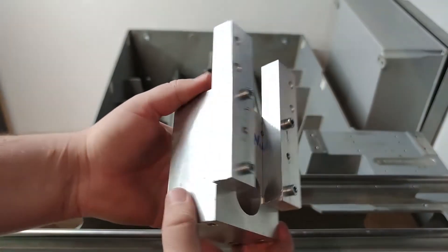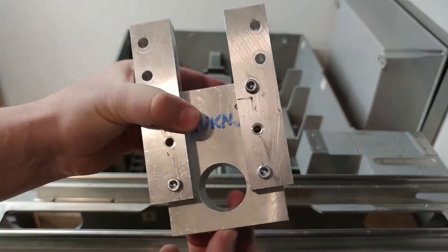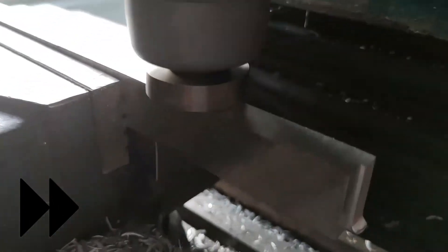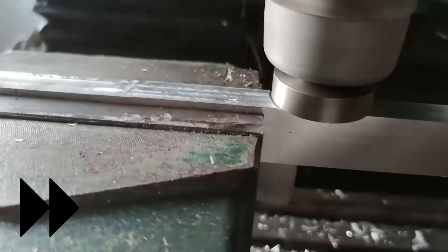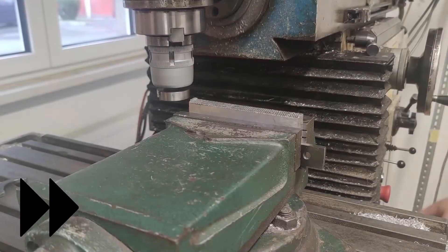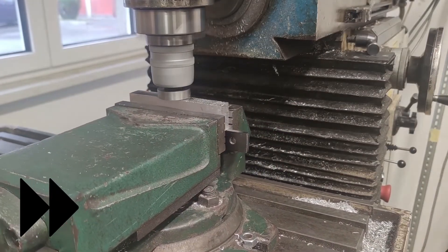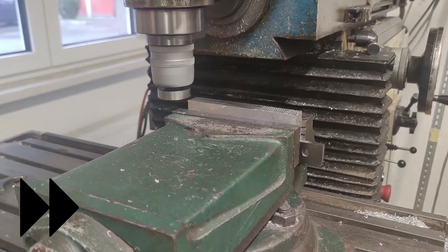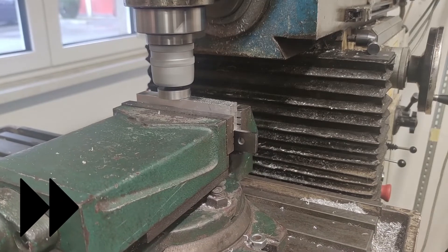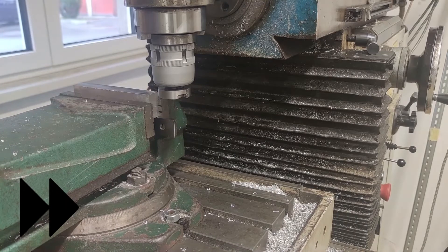Here is the mount for the ball screw nut. It is very precisely machined on the bore, but I had to machine two more blocks to mount it on the YZ casting. I found a long piece of aluminum and machined it flat, then cut it in half and machined the other side flat. Then I proceeded with drilling the smaller blocks as well as the block for the nut. All the dimensions had to be precisely measured to fit the existing holes in the casting.